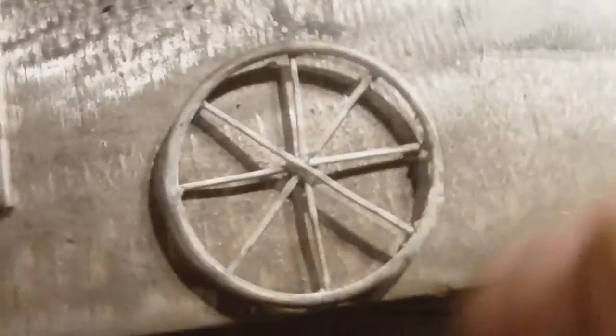So if you wanted to see how I welded these spokes, I've got my MIG welder, Lincoln MIG, and I've got it set on A in about 2, and I just spot weld, just give it about a 1/2 second burn on the other side here, and you'll soon catch on, and it's very easy to do. Now I'm going to space my wheels apart and start making the frame of this bicycle.